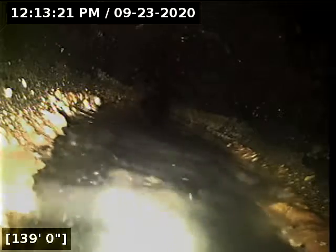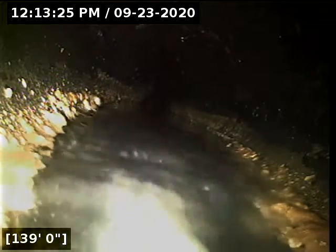And keep in mind that bellies that are out this distance from the building are far less likely to act up on you than bellies close into the building. I still recommend repairs because there's a fair amount of water here, and feasibly you could get a blockage. But at this distance, it would take some doing. It would be someone just balling their toilet paper up like crazy and dumping it down the sewer line. It would take quite the blockage to back up from 144 feet.